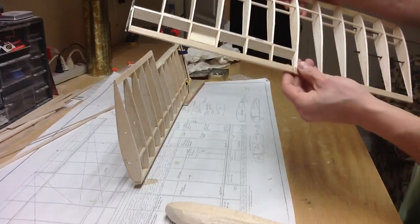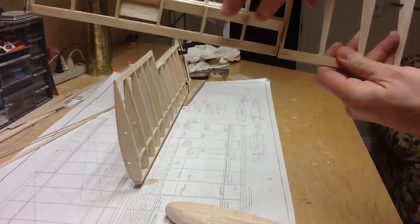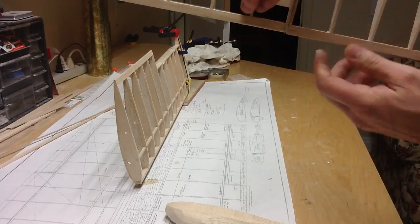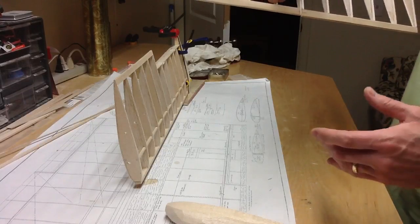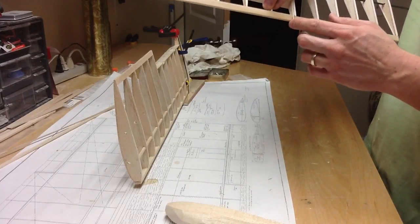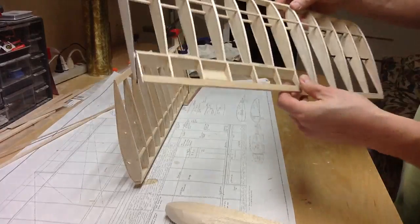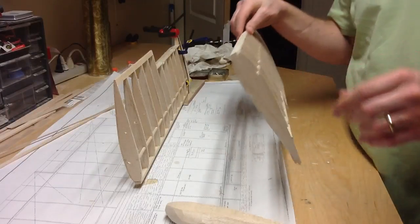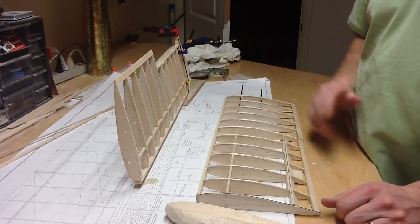I just did the back plate and cut them down. Make sure you don't have them stick out too far - if you notice, this one's a little short, and that's where you want it. Because when you sand this, it's going to be equal to that. When you're cutting them and mounting them, you want them to be the exact same length so when you sand them, they stay together.